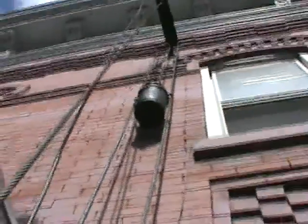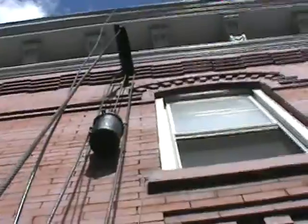Okay. The ladder, again, the same as all the fire escape, doesn't reach completely down to the ground, maybe by an inch or so. Okay. We have a weight receiver here that is broken. The weight system has some holes in the bottom, the weight case, and these cables are questionable too, since probably they've been here since day one.